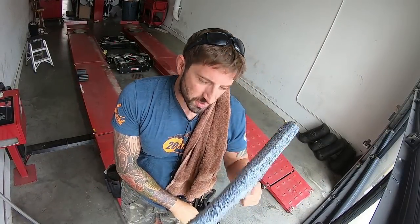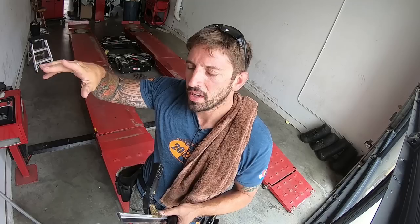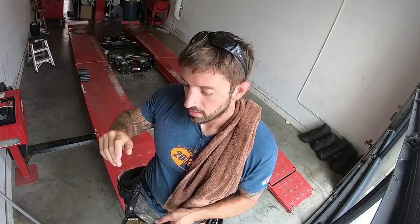On the storefronts I do, I always try to squeegee left, then squeegee right after doing all the uppers, so that I save the most time. It's always important to change out your tools as few times as possible so that you're not going back and forth constantly. Get all the windows done with two tools, then move on.